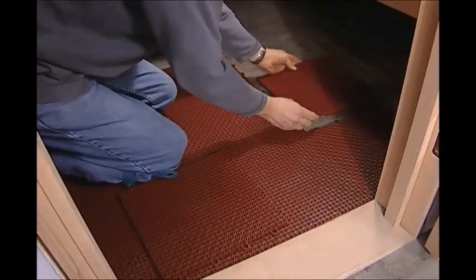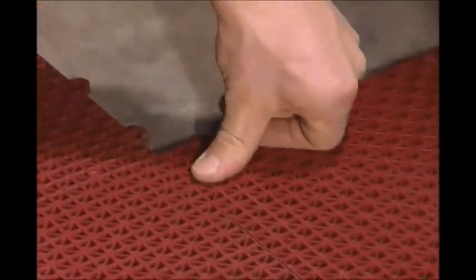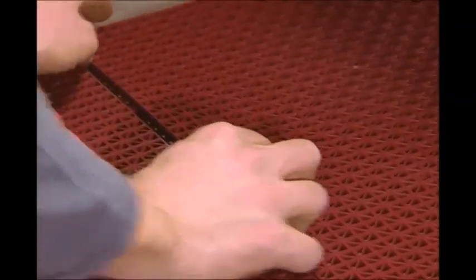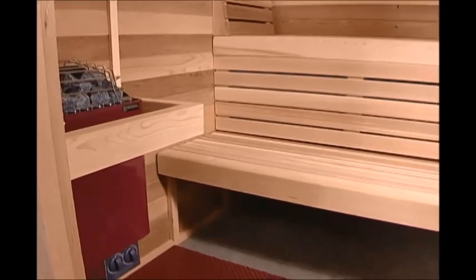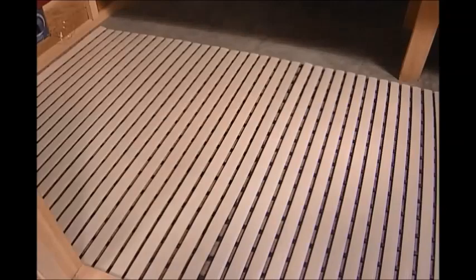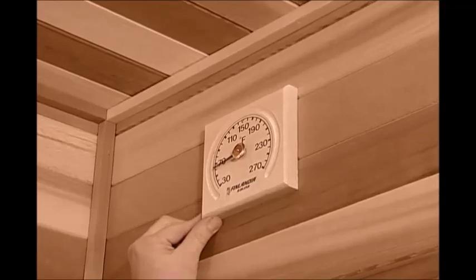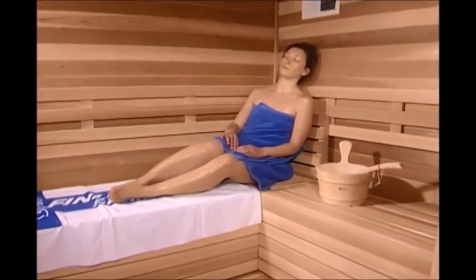Finally, install your super deck flooring — a plastic mat provided for the walking area of your floor. Super deck comes in 12-inch squares that interlock. Insert the tabs into the loops and press down with your thumb. Super deck may be cut with a utility knife to fit to size or to go around any bench legs. Your sauna comes with a super deck floor, but there are several floor options available, including a Euro deck option with several colors to choose from and two types of wood flooring. Install the sauna thermometer 6 inches from the ceiling above the heater. Now there's nothing left to do but enjoy your Finlandia sauna.